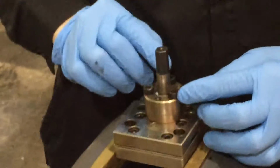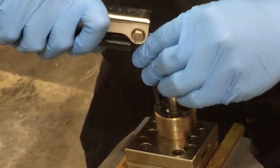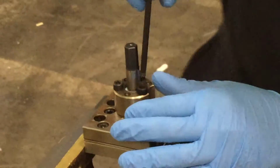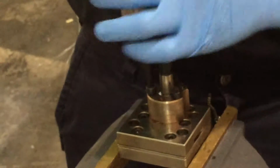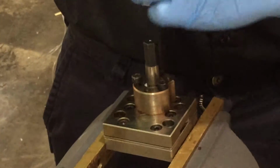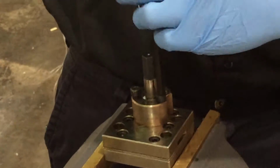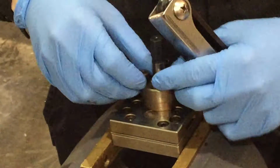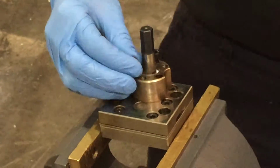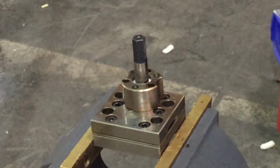Now you have 3 bolts here too. You want to take your metric Allen key. This one is 5mm. Loosen those, take those out. While I'm at it, inside along the shaft you will see packing up against the shaft. That is the vacuum seal. If the packing is fairly white, it's not black, your packing is fine. Place these on your workspace.